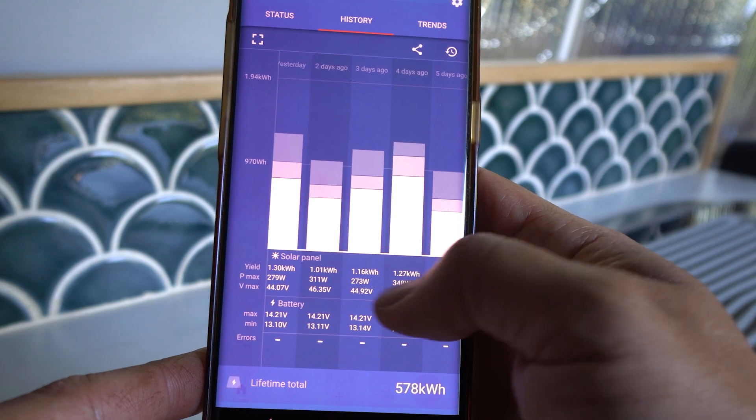About 90 to 95 amp hours is a third of my entire battery bank's capacity. This three-to-one rule came from years and years of using solar power and off-grid batteries. Having three watts on the roof to one amp hour consumed is just about enough to top off my battery throughout the entire year — in summer when it's sunny all the time, or in the dead of winter when it's hard to get sunlight. In summer I can be fully charged within a few hours of sunrise, but in winter it may take the entire day. On overcast or rainy days I may not fully charge, and that's where the three-to-one battery capacity comes in — having three times as much battery capacity as daily consumption means I can last three full days, enough time for the sun to come back out.